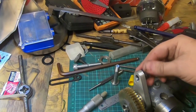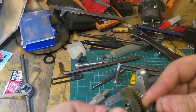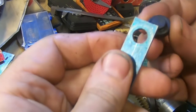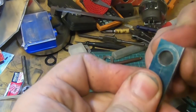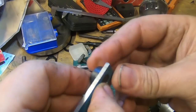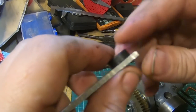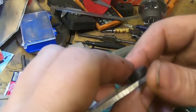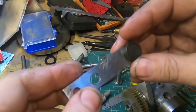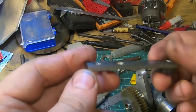There we go. We've got a nice hard steel button that's not going to mark up before the material that we're filing. This piece needs to be thinner than the material that you're filing so that you can still clamp this nice and tight and file around it in the vice. Leave that a little bit under flush, and make this, if you can, at least the thickness of the plate that you're going to file up. That helps get everything nice and square and flat. Next job with these is to file them up, put a slot in this one, tap that hole, and give this a clean up.